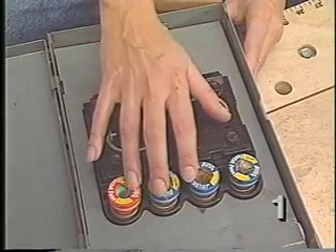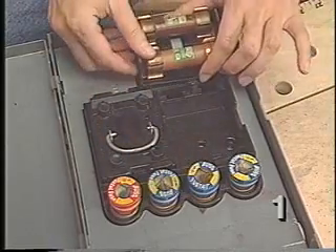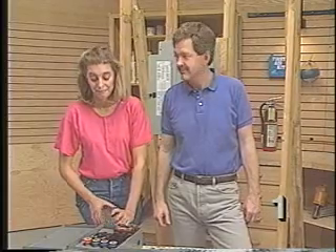You may also find fuses instead of breakers. Cartridge fuses are used for the main and for large appliances, and screw-in fuses usually service the general circuits. Service panels are tricky and can be very dangerous, so we recommend you don't do any work inside of yours — instead, hire a licensed electrician to do this part of the job. Now let's take a look at what our job will involve.